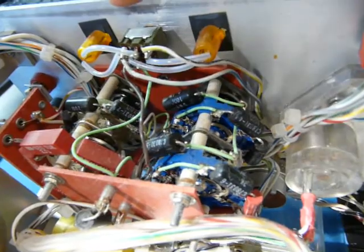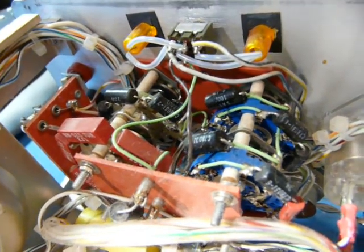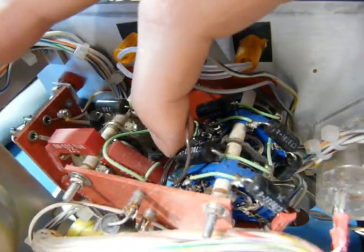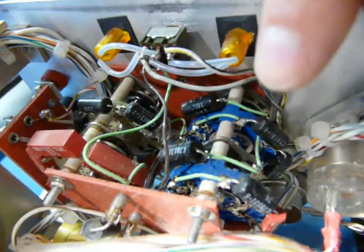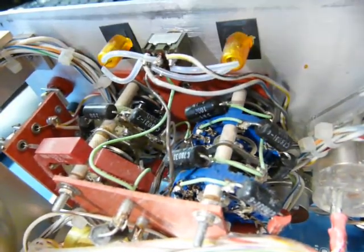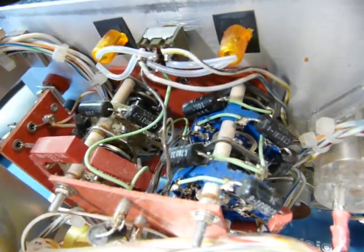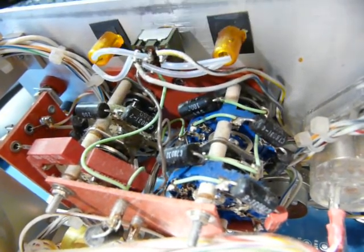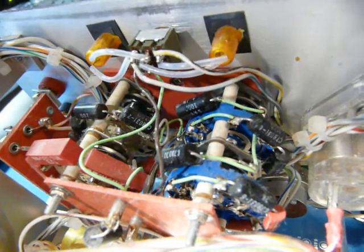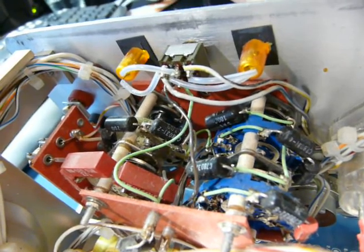So if these resistors are accurate enough, you get a very accurate resistance out of this thing. If you want to get really, really accurate, you can use a so-called Kelvin-Varley arrangement, but that's much more complicated. For an instrument such as this, you don't really need that kind of precision. If you wanted many more digits or to use cheaper resistors, then you'd want something like that, but for this, a regular old Kelvin arrangement is more than sufficient.